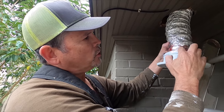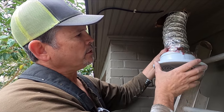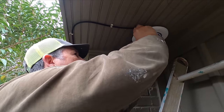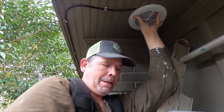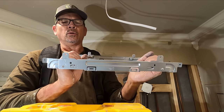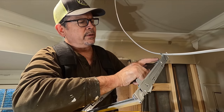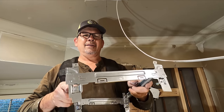This grill has three prongs on it that snap onto the wire embedded in this duct - that was a little hard to get on there, we really had to stretch it. So we taped it in addition to relying on those prongs so it wouldn't come off. This is the support frame for the fan and they really engineered it pretty cool - it flips up like that so you can get it in the opening. Once it's in the attic, you flip these down and drive these screws into the framing, and the fan attaches into these slots.